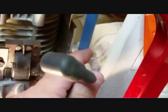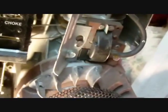This thing will probably start very nicely. As you pull the cord to start, this disc rotates and drives a current into this magneto voltage coil here, which generates a spark through this wire — which is why the spark plug gets power. So it's a self-generating unit for that reason, which everything like this is. But with a coat of rust on here, it's not going to do well. Having polished that, I think I'll get this thing started real easily.